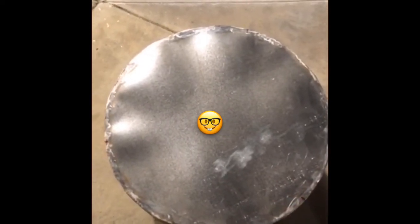You're not gonna cut yourself — it's all cleaned up, no burrs. Just gonna put the legs on now. There are the three legs; I cleaned up all the edges so they weld easier. I got three marks exactly 120 degrees apart by measuring the distance between them — 19 and a half inches between all three. That's how you know they're exactly one third of the way around the circumference. Alright, it's finally done and it came out good — it's gonna turn black after the first real fire.